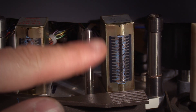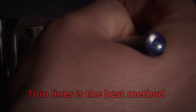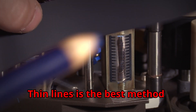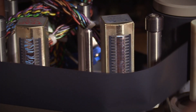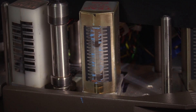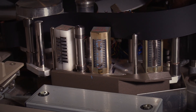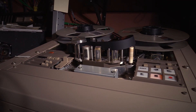I'm pretty happy with the reproduce head. For the record head, I'm trying different methods — I'm starting to think less china marker and a quicker test is better so it doesn't dry out. This china marker is probably about two decades old, which might be part of the reason. That looks about as uniform as it's gonna get — I'm digging where it's at. I think this machine is finally ready for an electrical alignment starting with the azimuth, so I'll do another video on that. See you guys soon.